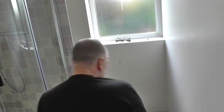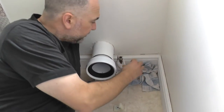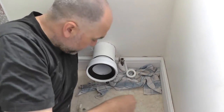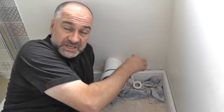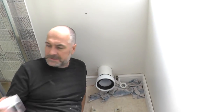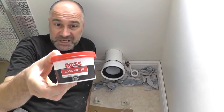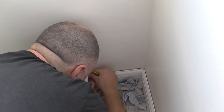There's a little bit of an issue down here, and it's all about this bloody pipe. This nut — I can't get it off. So what I'm doing is just getting PTFE tape and wrapping it all around in there, and basically just pushing it down with a pencil just to get the PTFE in there. Then when I've got that in there, I'm going to put boss white on it, which will make a really, really good seal and solve the problem, creating a nice watertight seal.